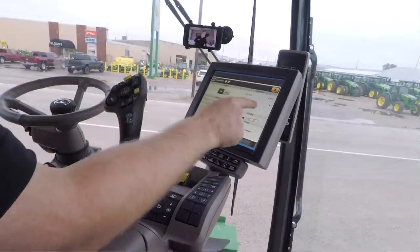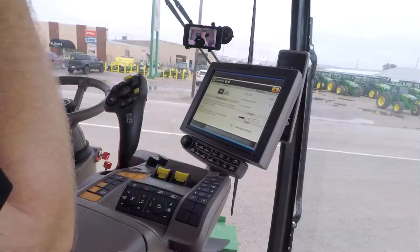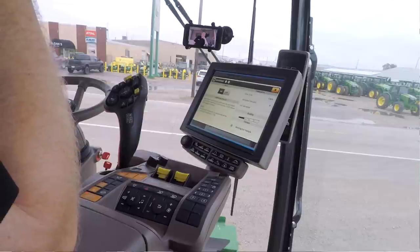If you'd like to do some calibrations like we've done before, again, do your normal harvesting speed, maybe a half speed and a three-quarter speed, and then maybe one that's a little faster than normal. You can certainly do all that, and it will help the system get there quicker and a little bit more accurately. But even with that said, you still need to wait until you have at least 15 accepted samples before you go ahead and start to evaluate how the system's doing.